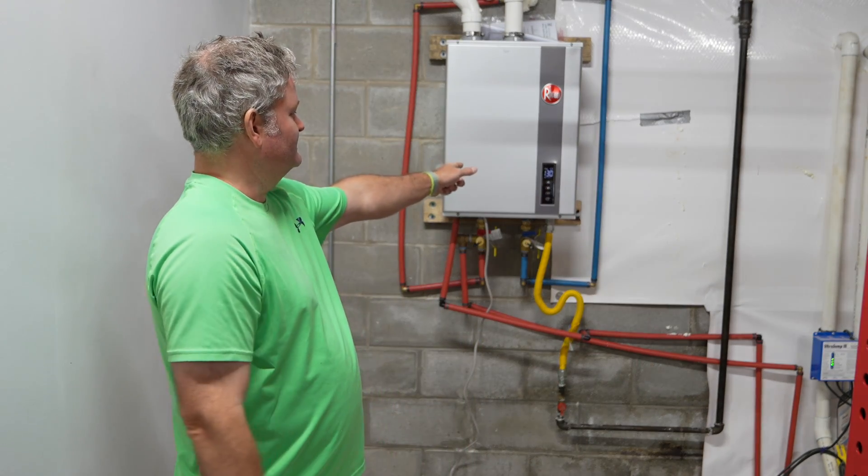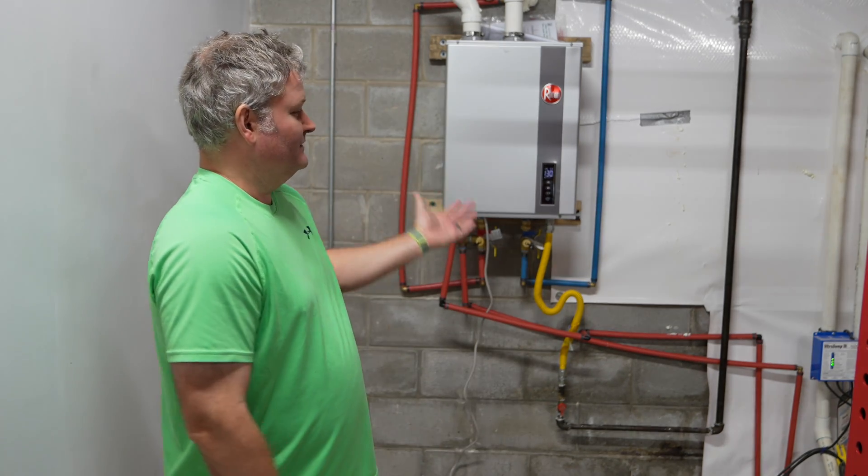You can hear my tankless water heater — it just came on. They're so quiet. If you just look at where you live, calculate the numbers, and write down each type of sink and showerhead with the estimated GPM — and if you've got time, get a bucket, go to each faucet with your timer app, turn the water on full blast, hit the timer, and get an exact gallons per minute flow rate.